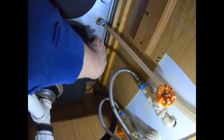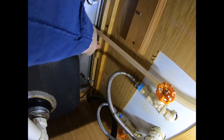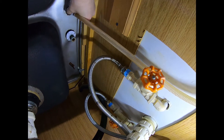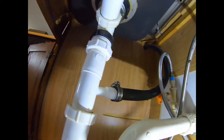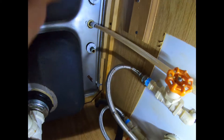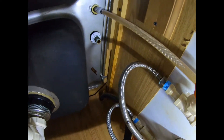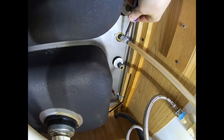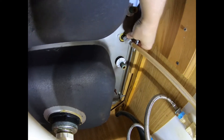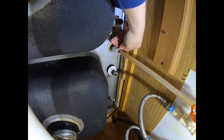Now we have to deal with the sprayer. Not sure how that comes apart — this sprayer unit... looks like I could pop it loose with a screwdriver. There it is — see there's a clip on there. I'll show you how that comes off. Just flip that off. Remember this is a tight fit — I'm laying on my back in here. There we go. Now take the sprayer down.